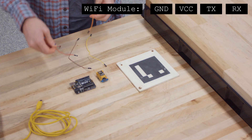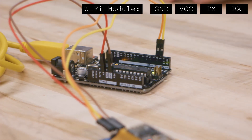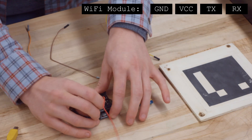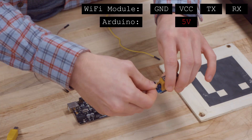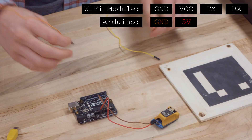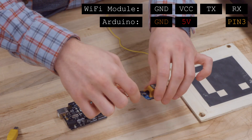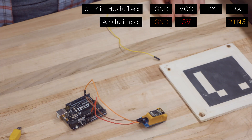VCC takes in a 5V charge. Ground should be grounded to your Arduino, and TX and RX should be connected to the Arduino via digital pins. Insert the Wi-Fi module into the breadboard and hook up the wires so that the 5V connector runs to the VCC and the GND connector runs to the GND pin on the Wi-Fi module. We can now insert the RX pin into any digital pin — I will connect it now to pin 3. The TX pin has requirements on which digital pins it can use depending on the board, so check out the link in the description if you are using a Mega, Leonardo, or Romeo to determine what pins are available to use.